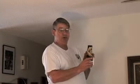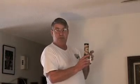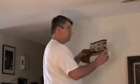You've got your thumb and middle finger around the Border Buddie finger guides that go to the back plate, and you have your forefinger up alongside the border to help control it as it spools off of the pin. So you just take the sponge and you slide it right along the bottom of the border to catch all of the water and the glue before it drips down the wall. And just watch and see how I do this.